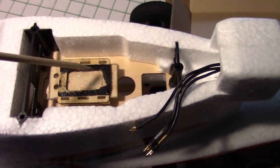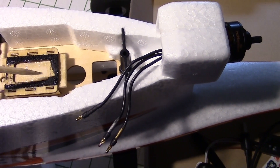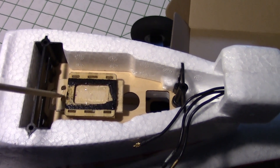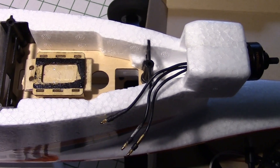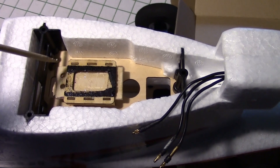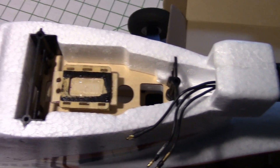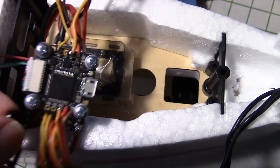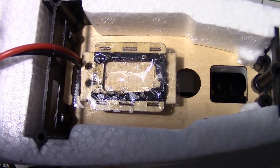I'm getting ready to mount the Brain FPV into the plane. What I've done is slid a piece of plywood underneath the tray and glued it in with some CA. I've drilled two holes in that plywood so I can strap down the battery lead — sometimes when you're connecting the battery you tug on those wires and I don't want to rip them off the circuit board. I then put packing tape over the top of the platform and ran the screws through the tape to mark the positions, then used an electric drill to drill the four mounting holes.